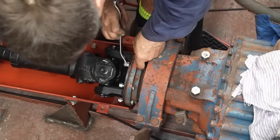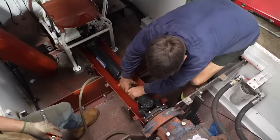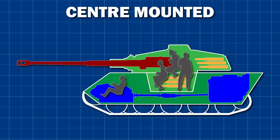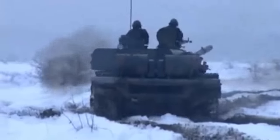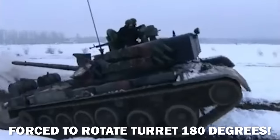Another issue is the fact you have to actually connect your transmission to your engine using a drivetrain. This will need to run underneath the turret, meaning the entire vehicle needs to be significantly taller to compensate, giving it a larger silhouette, and in vehicles that don't have a turret basket, getting in the way of the gun crew. A less important but still valid problem is gun overhang. With a long, high velocity anti-tank gun, the barrel tends to extend quite far over the front of the vehicle, meaning it can get caught on obstacles or limit the vehicle's ability to cross trenches or navigate hilly terrain.